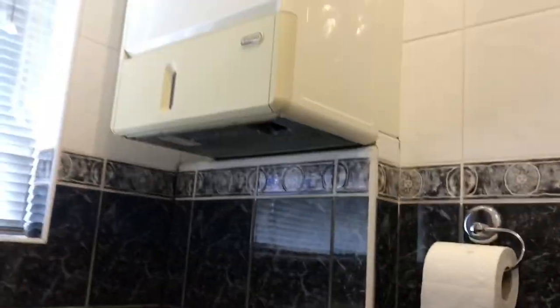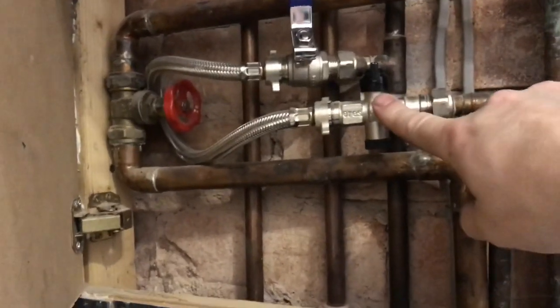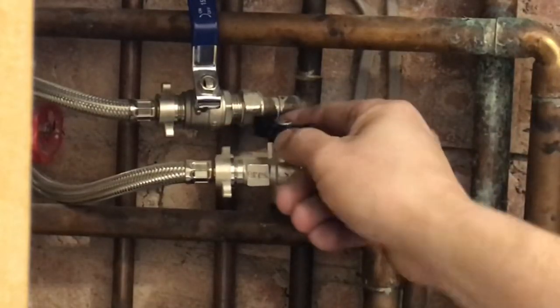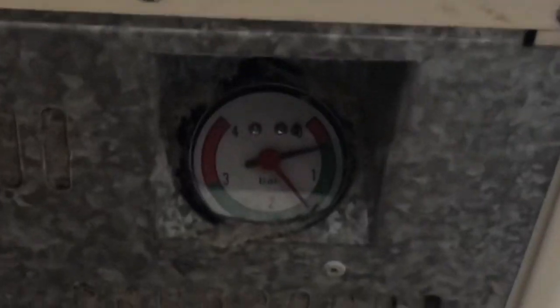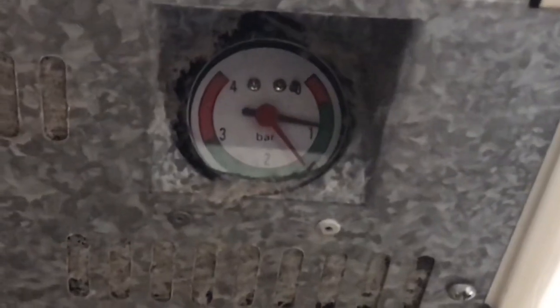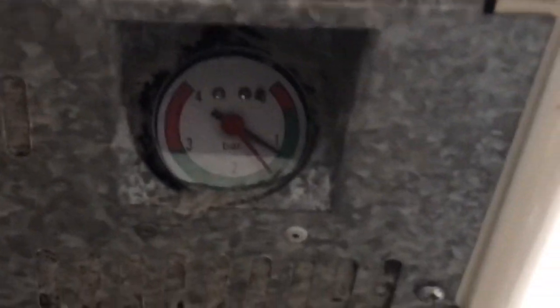On mine the boiler is situated here in the bathroom, and below it is this cupboard. If I pop the cupboard open it reveals the pipes. What you've got here is a non-return isolator valve and then the water feed to refill the system. To start with, open up the non-return valve like so, and then looking at the pressure gauge on the boiler you can see it's down in the red. We're going to open up this feed — you can hear the water going in — and watch the pressure rise on the gauge until it gets to just over the one, which is about there, then lock that off again and turn off the isolator.